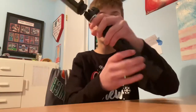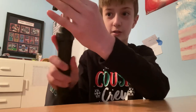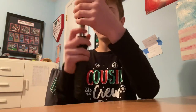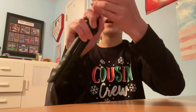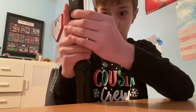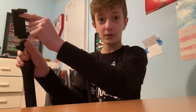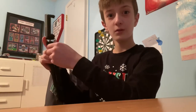Right here you can unscrew and adjust this part, or take it off if you want. This little metal knob right here lets you tilt the head all the way downward. To keep it stationary — like straight up — you hold it in position and turn the knob toward you to tighten it, wherever you want to position it.